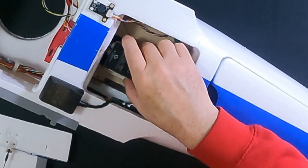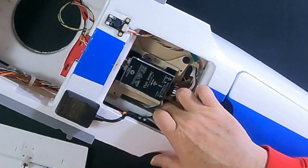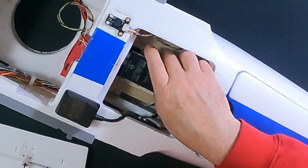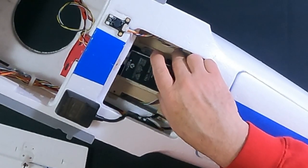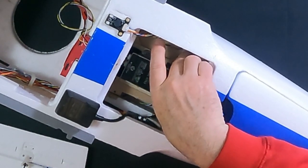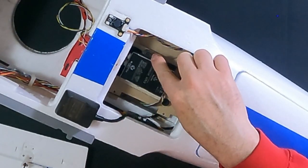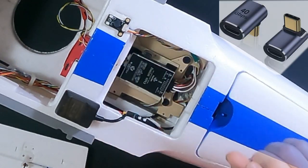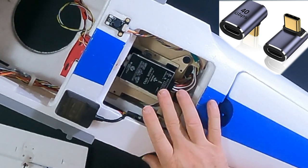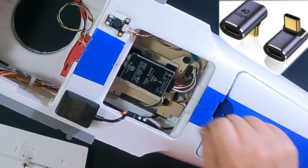I love how this flight controller is mounted. The mounting board has rubber standoffs for vibration protection, and I screw the flight controller into that top board so it still gets the benefit of the rubber mounts while giving access to almost everything. I've installed one of these little L-shaped USB connectors because it's so hard to access the USB port from the side — it's really easy to just get a USB adapter like that to plug in.